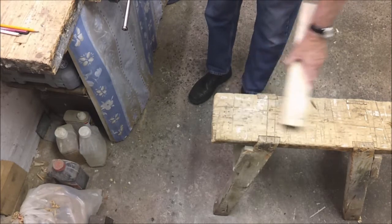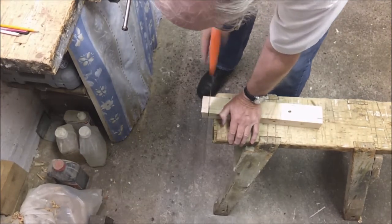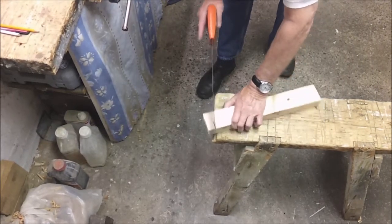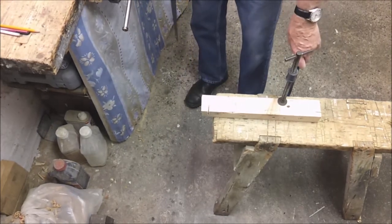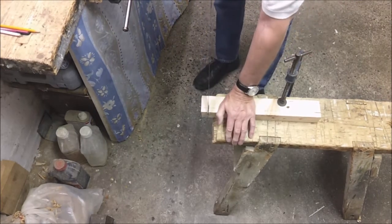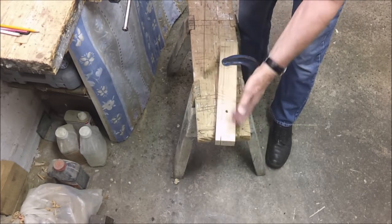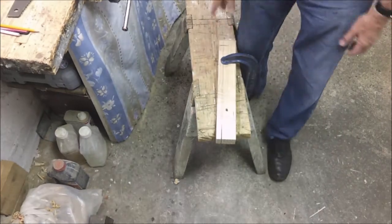Alternatively, I'm now resting on a saw stool, so I can just lean on it with my hand and press down. By pointing the saw downwards I'm helping to keep the piece of material hard onto the surface. If I try to go the other way I'm back to the problem of the piece of wood sliding about. Another way of anchoring your piece of wood is to clamp it onto a bench or some other surface — now we can cut very effectively because the piece of wood can't move. If I wanted to saw all the way down, I've clamped it again and now I can lean over, then every now and again push the piece of wood up and re-clamp it.